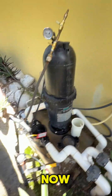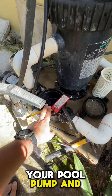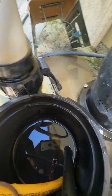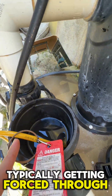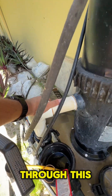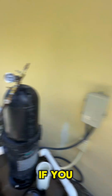So you can either snap this line, or you can do what I'm doing right now — removing the lid for your pool pump and injecting into the back of the pump. If you look at my pressure testing plug, we've got a port where the water is typically forced through the pump into the filter. I'm injecting straight there, so my pressure is going through the feed line, through the filter, through the return line, and into the pool.